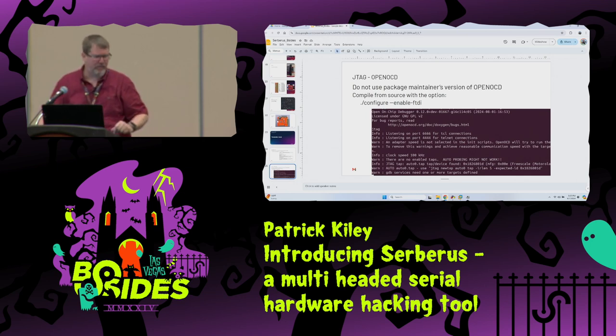For JTAG, now it's getting a little bit more complicated, and I'm going to show the demo of that in just a minute. If you try and use OpenOCD out of the box, just do apt install OpenOCD, it probably will not work. The package maintainer's version of OpenOCD doesn't have all of the FTDI chipsets supported out of the box. Fortunately, it's very easy to build. There are very few dependencies. You can just pull it off of GitHub and do a build. And then when you're doing the configure, you just have to enable FTDI or any other additional chipsets that you want to use.